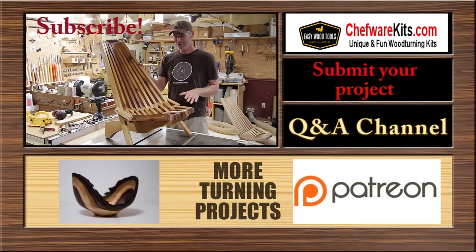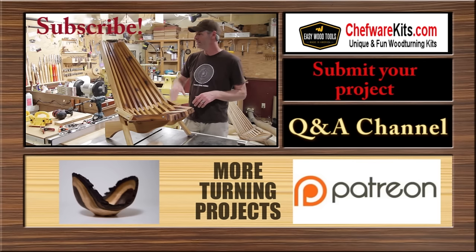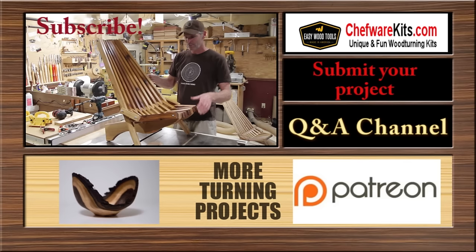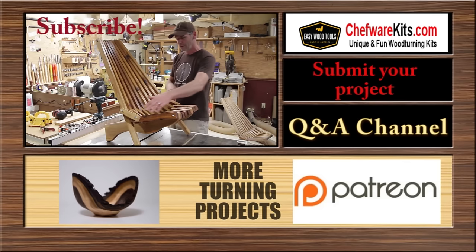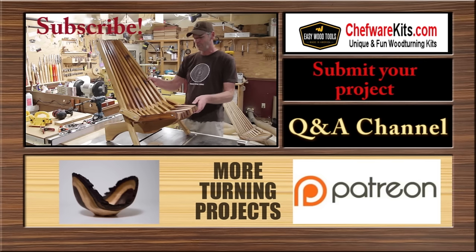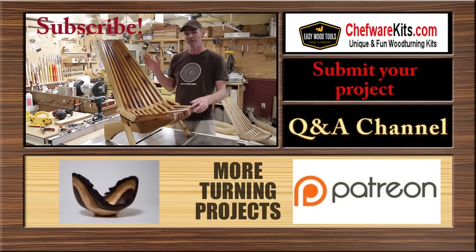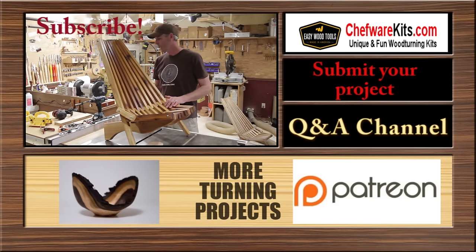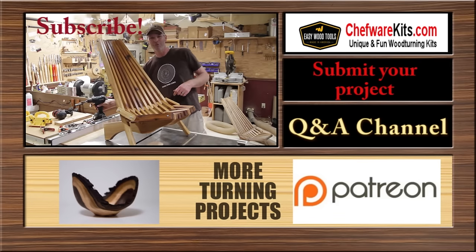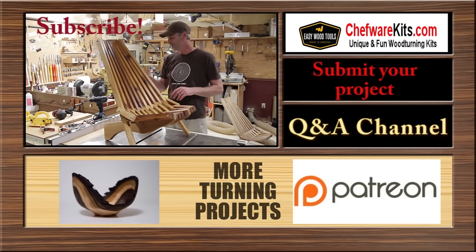There we go. I'll put the cut list in the description too. It's a pretty simple project and can easily be done in a day. This one's a little bit short for me so I'm going to make one for myself that's about six or eight inches taller. You could even customize the width a bit — maybe put in a third rear leg and make a couple more of these pieces. I really like the way Tim did the alternating colors. There are just two things to keep in mind: make sure the holes are drilled the same — set up a stop block and a fence with your drill press — and don't try to feed the threaded rod through by hand. Hook it up to the drill and it feeds right through. Once you spread them apart it's a giant pain, so hook the drill up.